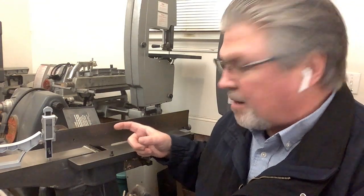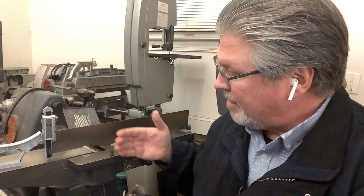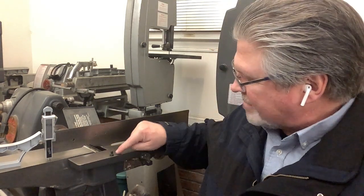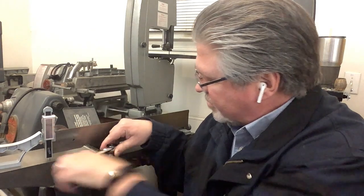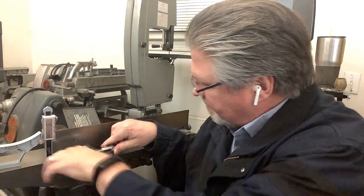One other thing I was curious about is, did I get that blade set laterally properly? If you saw on that video, I was using a straight edge against the outfeed table to set the blade, so I would make sure that the blade for rabbiting was cutting far enough away from this ledge that that ledge doesn't get in the way. We can check that out here if I take that stud out. So let's do that. This is the stud that on the Shopsmith feather guard allows us to lock the feather guard in place to where it will support stock against the fence.